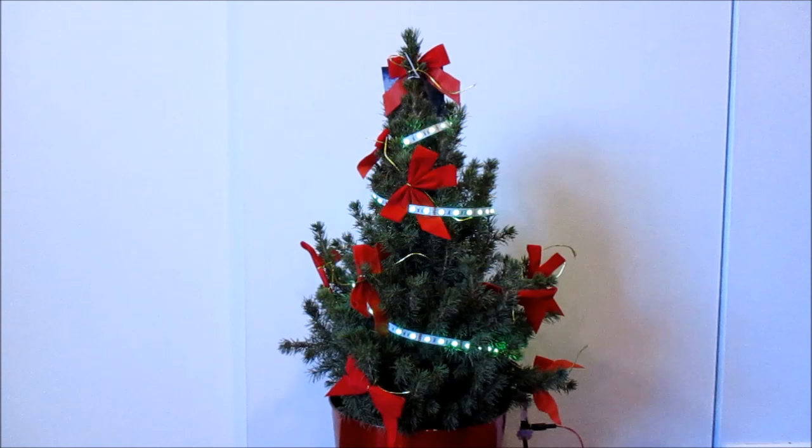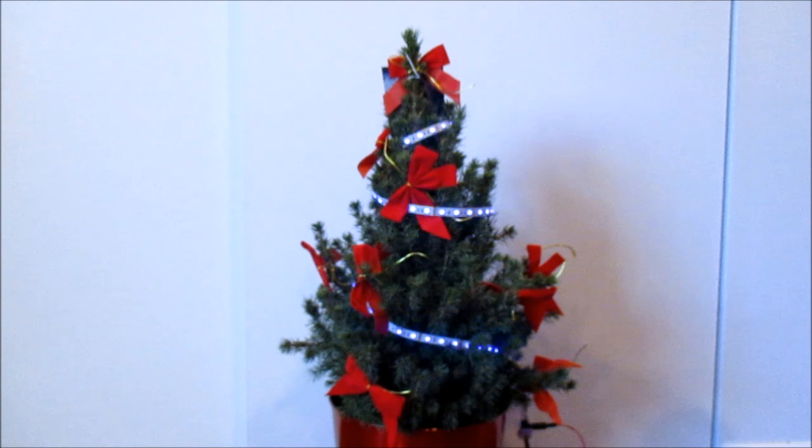But I prefer to have my lights smoothly pulse. So they start at a low power, they speed up in terms of brightness, and then they very slowly approach a brighter light. And in this way, they kind of have a pulsing motion as opposed to just on and off as if they were blinking. And I accomplished this using a sine function.